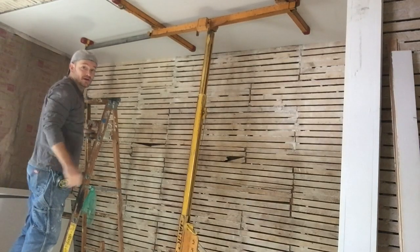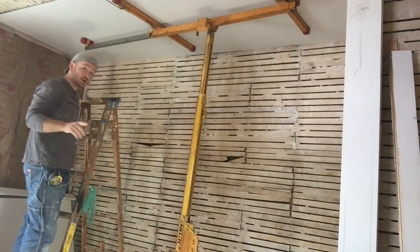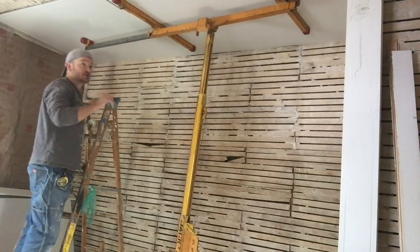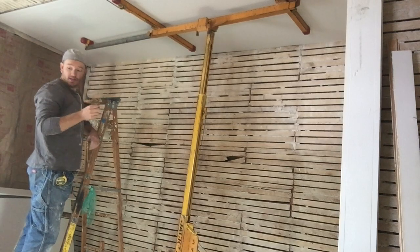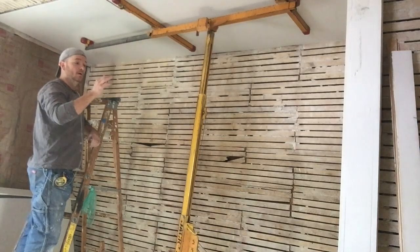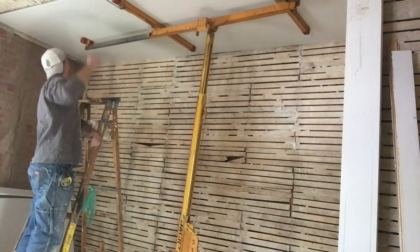Woo! All right, first piece of drywall is actually up here now. I got to put some screws in. I'll talk a little more specifically about the process for putting screws in, but I have just a basic drywall screw, okay? That will work their way in. These are 1 5/8, pretty common size. You can get them anywhere. And this is now ready to be installed.